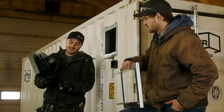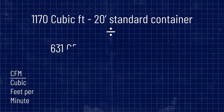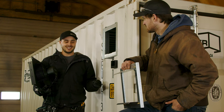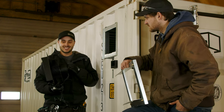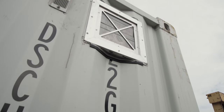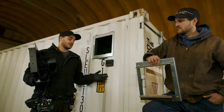With these fans, they have 631 CFM. The amount of air inside a 20-foot container means this thing will exchange the air about every two minutes, which is crazy — that's a lot of power. One thing to note is that these need to be coupled with intake dampers. We use two 10-inch intake dampers for one 10-inch exhaust fan, which seems to balance the airflow quite perfectly.